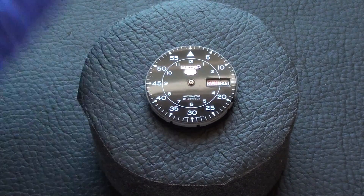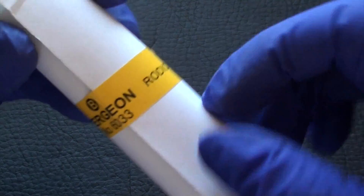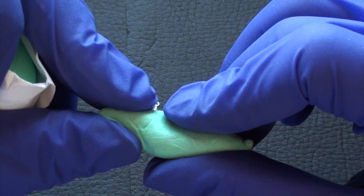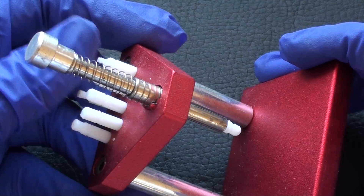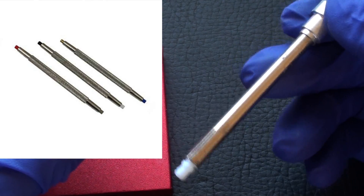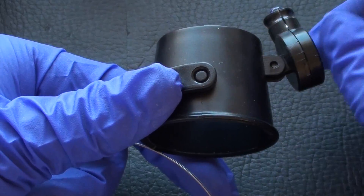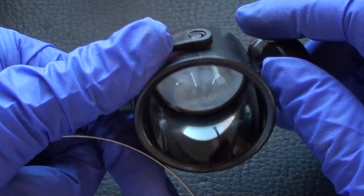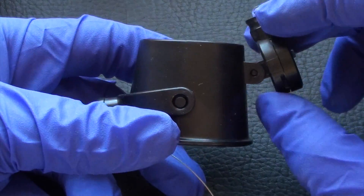The tools that you need for this particular tutorial are your movement, your handset, a precision tweezer, or some Rodico. Rodico is basically this sticky putty material that's meant for cleaning or picking up stuff, specifically for watchmaking. And a watch hand installation tool — this is a hand press. You can get it very cheaply on eBay. The other option is hand press tools which you manually push in the hands with. Something optional would be a loupe. This does come in very handy, especially for hand installation, to make sure there is enough clearance between the hands when you're pressing them on. This one is 15X, and I like it because I can wrap it on my head without having to hold it as I work on the watch.